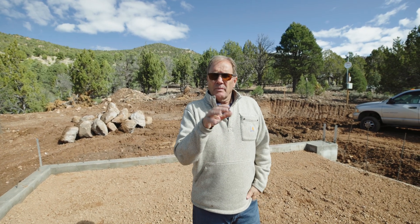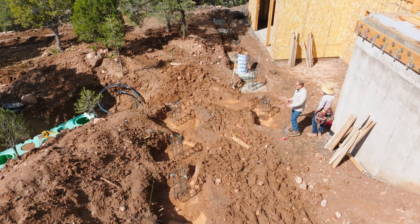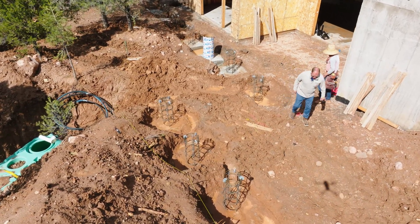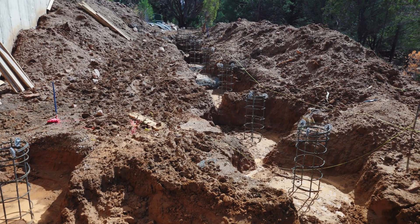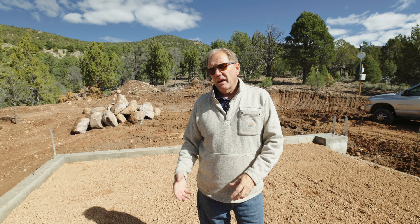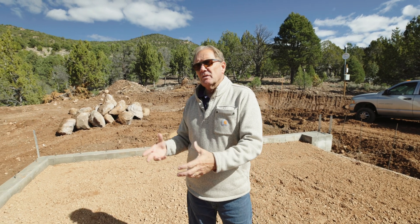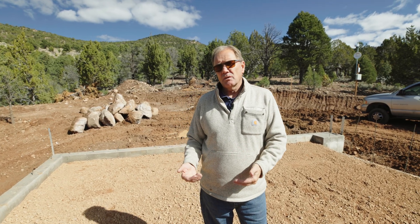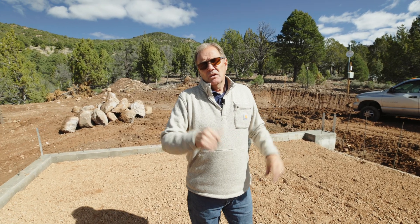I wanted to mention one other thing about those piers down below. I chose to go three feet because I looked at the grade of the hillside. By going up three feet, it gives me flexibility on where I'm going to put that grade — you'll see that as those piers go up that hillside. If you put them too low, it limits where you can put your grade. Going higher also keeps the wood structure up and away from the dirt and away from the elements. If you're doing piers, I love to see if I can get them out of the ground a little bit more than what the engineer was approving. He approved what we're going to do, so it all worked out.